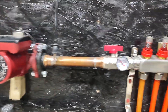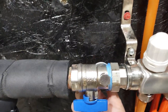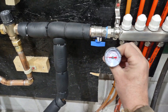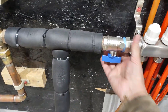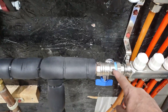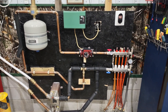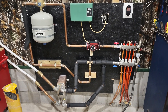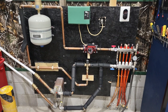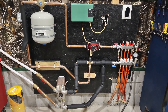I did turn the system on just so you can see it flowing — that is hot. The pump is very quiet. You can see right now my supply side is about 100 degrees. The return side is at 70 degrees. I had a bit of a leak and had to turn this valve to tighten it, which put it on the opposite side — I just need to flip it back. As for leaks: wherever I soldered, no leaks at all. I used Teflon paste for my fittings — Blue Gorilla or Monkey or something like that — and it was horrible. Everywhere I used that paste I had horrible leaks. I had to take it apart, clean it all off. The answer was using Teflon tape and then paste over it — tightened everything down and my leaks have now stopped.